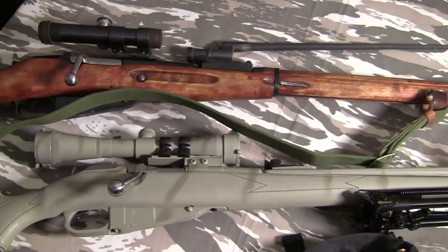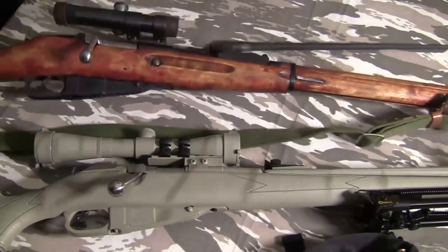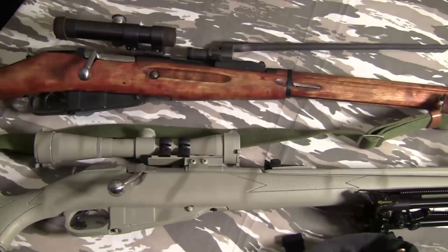Once you've got all that out, take some sandpaper to sand it down. I started with 400 grit and went to 600 grit. The Mosin stock is birch wood and none of the stocks are going to be really pretty, so you don't have to be too particular about the sandpaper. Then get your favorite stain and slap it on — just rub it with a clean rag. Some people use polyurethane; I like to use tung oil. Give yourself a nice coat and that's all you need. When sealed like that, your gun's good to go.